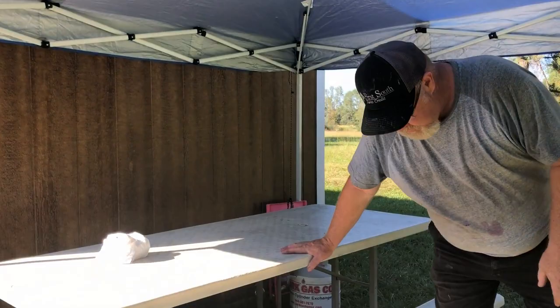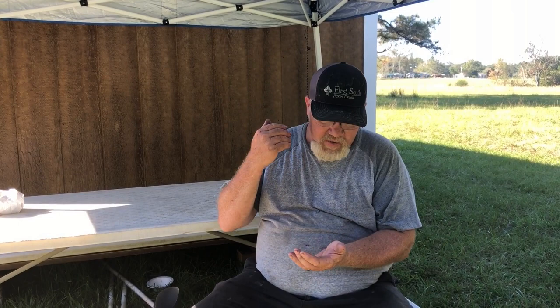So what have we learned from putting water in? Well, we've done water lines before on a very small scale. We've repaired water lines, but we've never taken on 1,100 feet of putting our own water line in. But I want you to know that it is possible for you to do it. You can watch some videos, learn how to do it. It's just a matter of the glue and the primer and the pipe, putting it all together, digging your holes, making sure you're under your frost line, and then tying everything in.